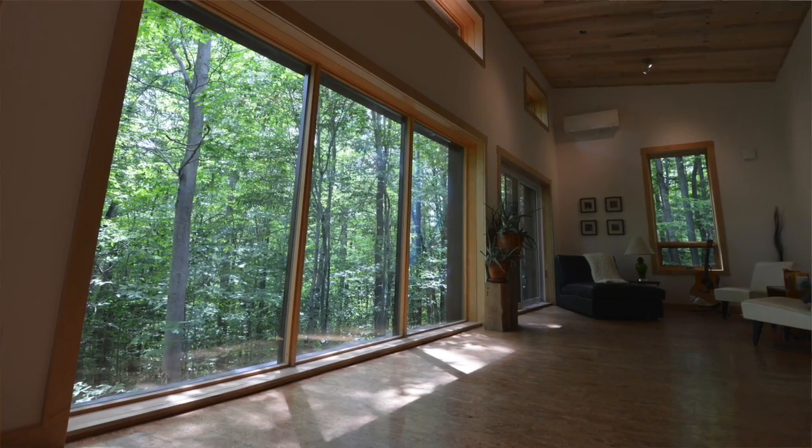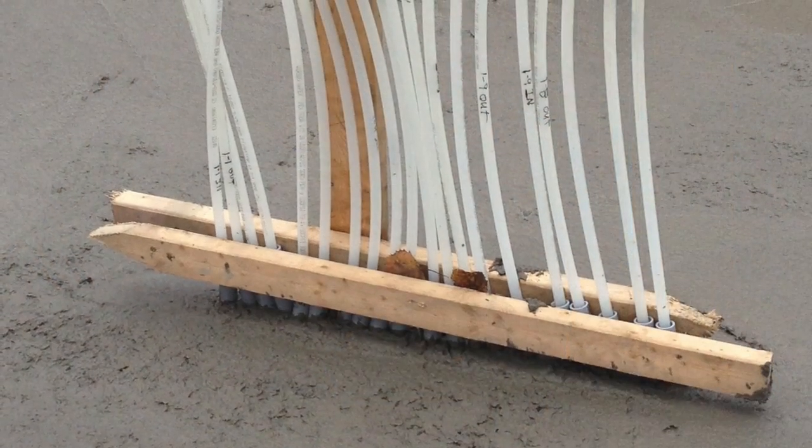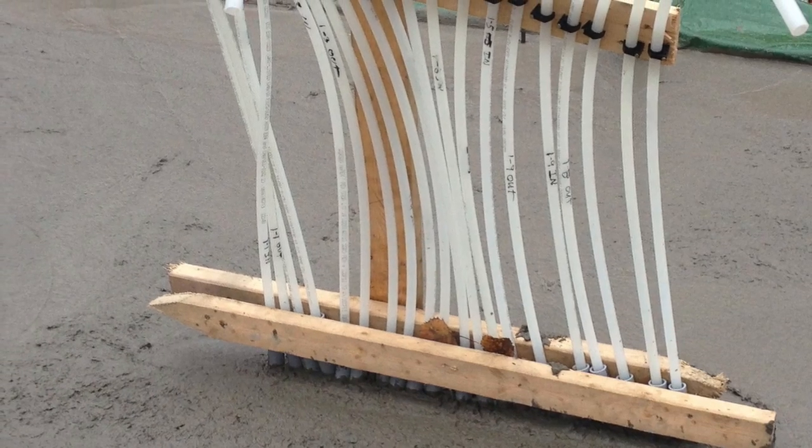In the demo house we have a lot of windows and this slab always remains closer to 22 to 23 degrees. But on the north side of the home we don't have all this passive solar gain, so a zone system becomes quite interesting to have for increased comfort. Cold feet means you have to compensate with warmer air, and when we want to keep air at around the 21 degree Celsius mark, it's nice to keep that.